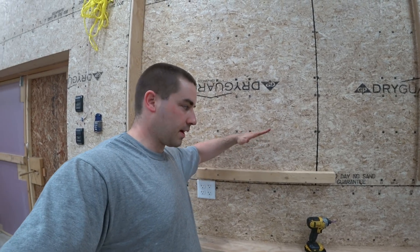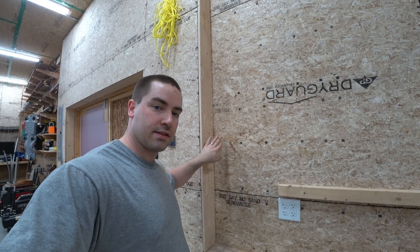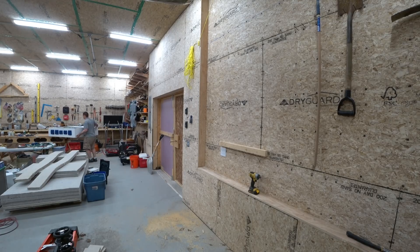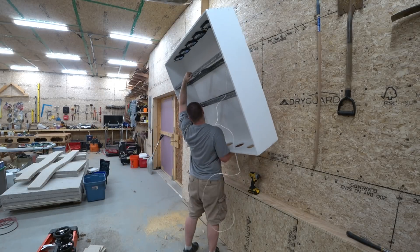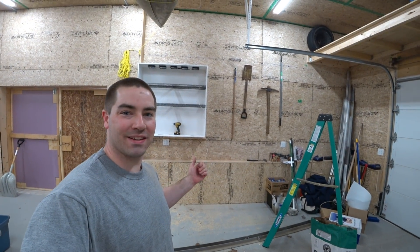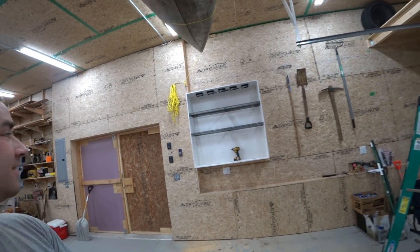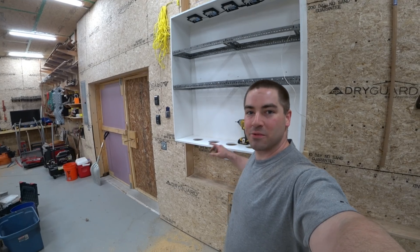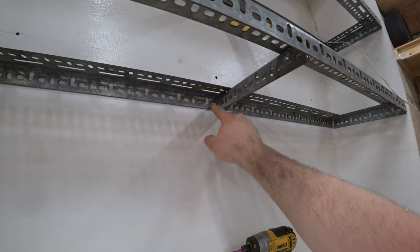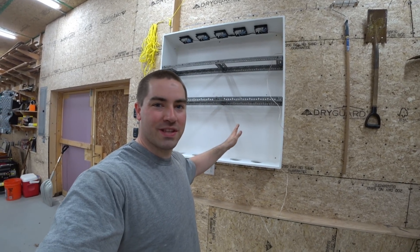The cabinet box is probably around 90 pounds. I've already put a cleat on the wall that is level, so I just have to set the cabinet on the cleat and then slide it over until I hit this edge and those holes should line up. There's the cabinet — that's where the batteries are going to go. Now I'm just going to add more screws. I was putting these screws into the steel bracket so it would hold both the cabinet and the shelf. Got the cabinet up, anchored into three studs — I don't think it's going anywhere.